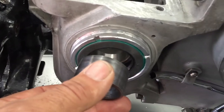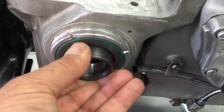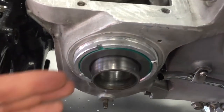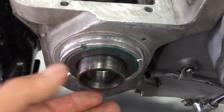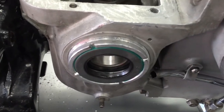Always install the collar with some oil on the outside. It's a common mistake — people install seals dry. What happens is you've got rubber on a dry metal part, it starts turning, and it actually ruins the seal before you even start.